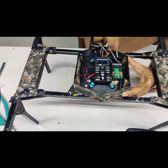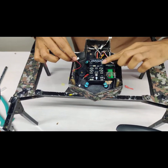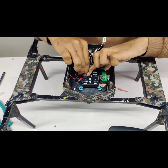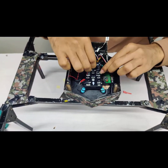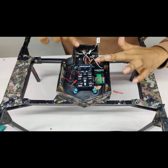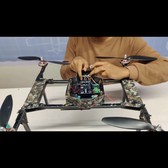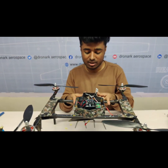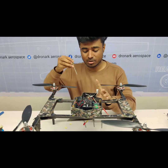Now we connect the telemetry wire to T1, not T2 — T1. That's fixed. Then we connect the buzzer to the buzzer port — that's also fixed. After making all connections we move on to the motors. I made a note to remember motor 1, motor 2, motor 3, and motor 4, so I don't miss anything.